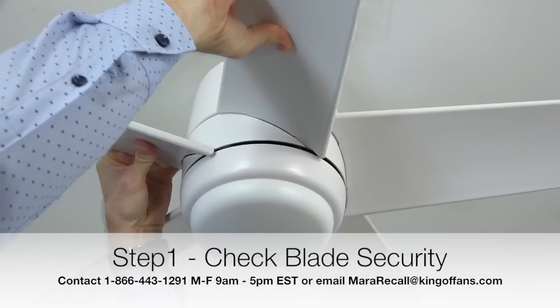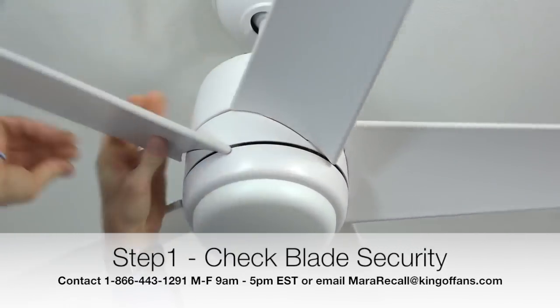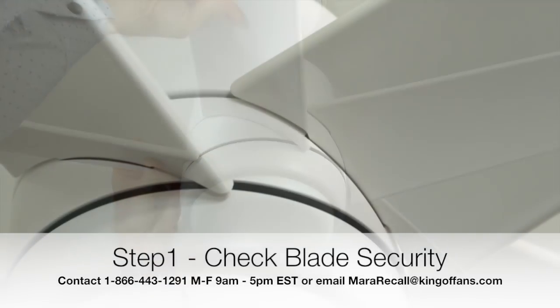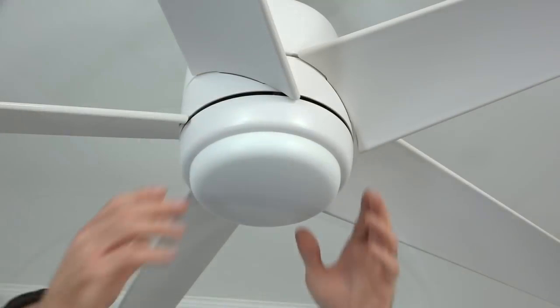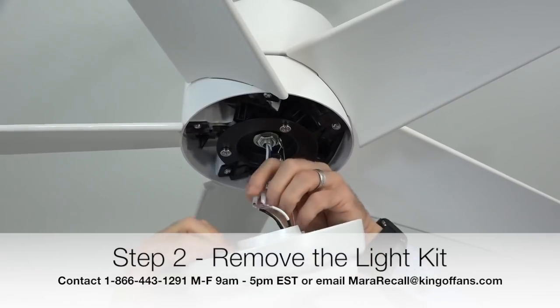For each blade, grasp the blade and attempt to move it back and forth within the fan body. When installed properly, there should be no movement between the blades and the fan body. Avoid moving the blades up and down to prevent damage to the blades. Look for any uneven gaps between the blade and motor assembly as shown here. If any blade movement or uneven gaps between the blades and fan body are identified, please discontinue use of the fan and contact us.